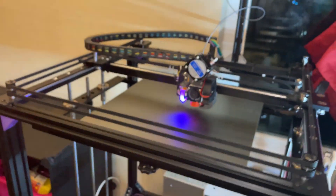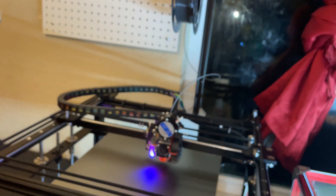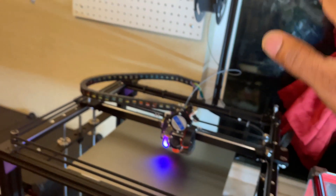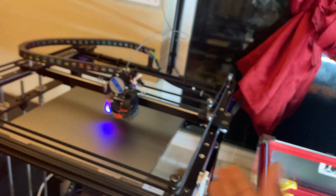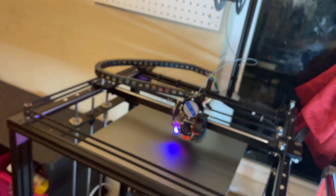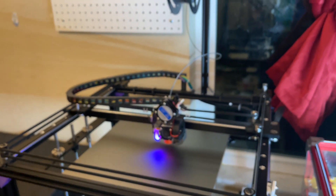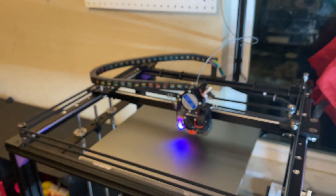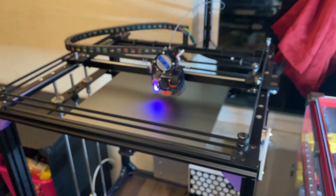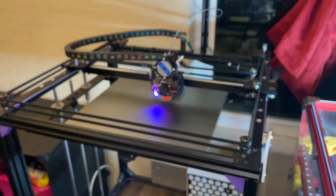The new mods I've added: I got a 9mm thick 6061 aluminum plate for the bed. It's a bit heavy — when the motors turn off after a print, it literally drops. I don't have an anti-backlash nut and I don't think I need one since it's working fine. What I might do is add a macro in my config to prevent the Z from turning off after the print is finished, maybe put a delay of an hour or two so the print can cool off before it drops.